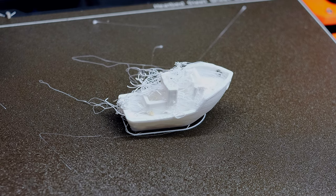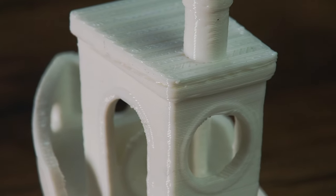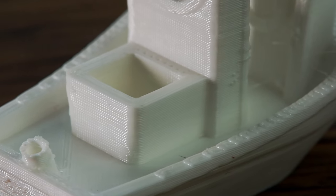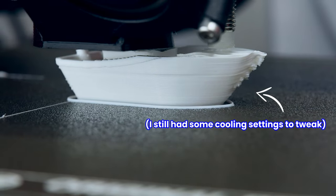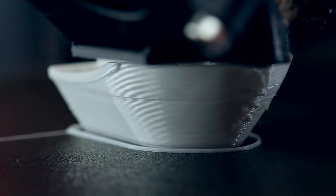Yeah, I probably should have thought of this ahead of time. I didn't change a single setting for this. If you're curious about how I do my time-lapses, I've got a whole video about it. I needed to make sure this was in fact a problem with doing time-lapses of NinjaFlex and not an actual problem with printing NinjaFlex — easy question to answer, just print one without a time-lapse. This is a bit more like it. MRA's NinjaFlex profile really was a great place to start from, and I was amazed at how much retraction I was able to get away with on my Prusa — a whopping 5.5mm — given how everyone usually tells you to use little to no retraction for flexibles. Being a forever perfectionist, I wasn't entirely happy and tweaked things further, which also escalated into trying to figure out the time-lapse settings.